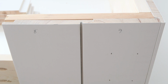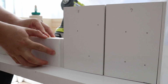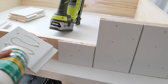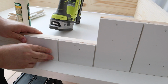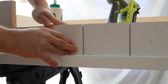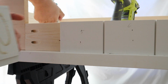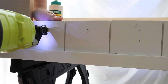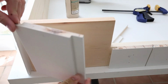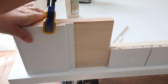Install the next 7 1/4 inch shiplap board to the left of the first board on the front. Then install the 4 3 1/2 inch boards to the 1x4, continuing from right to left. After attaching the 4 3 1/2 inch boards, attach 2 full 7 1/4 inch boards on the left corner as shown here, so the corners look the same as the right corner.